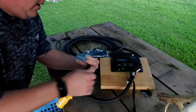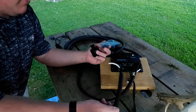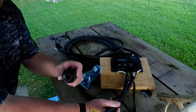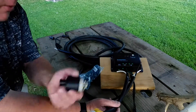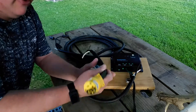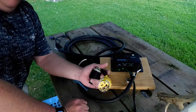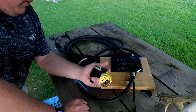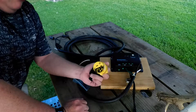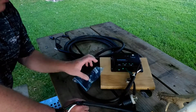What I initially had done was I had this three prong plug wired into here, and the other plug wired onto the end of the cable — and that's what I pulled apart in the parking lot of Cabela's. I didn't mark the black and the green. I'm using the black and the green: black for positive, green for negative on this system. So what I'm going to do here is take all this apart on video and reattach it.